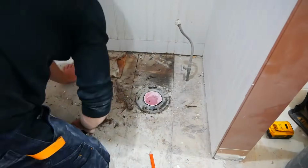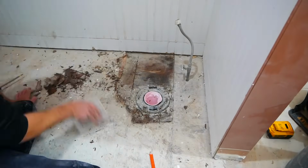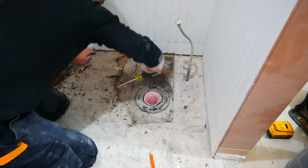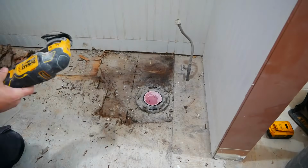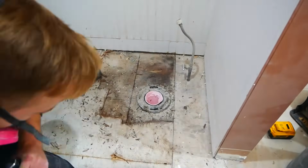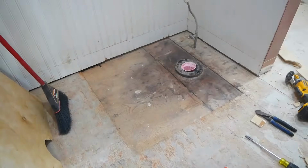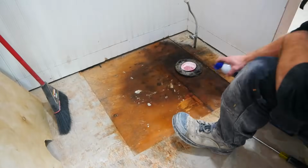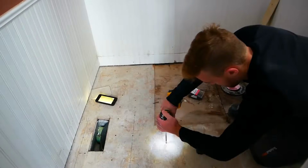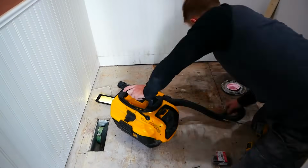When I ripped out the old floor, I noticed the section around the toilet had rotten. This was 2 layers, the top layer being 1/4-inch ply, and I was easily able to poke through it with a screwdriver. The bottom layer, while discolored, was actually still really solid. So I ripped out the top layer, sprayed the bottom with some mold killer, and put a new sheet over top. I then secured it all down with some flooring screws and got rid of any other squeaks in the floor.